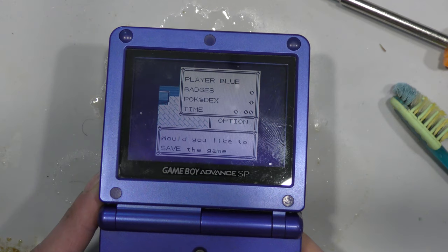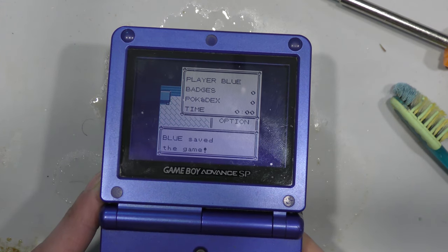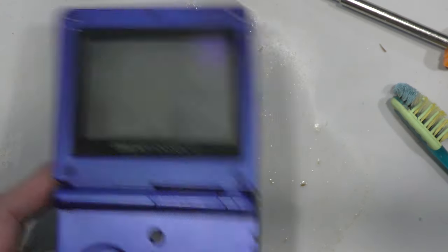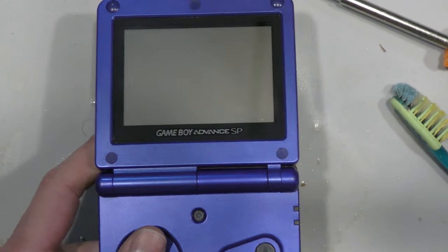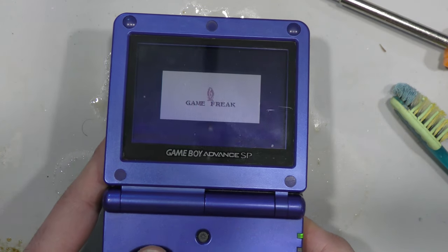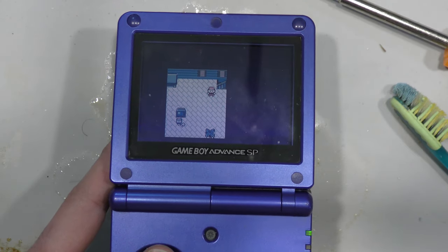have to do is reflow those chips, and anybody who's watching this video can do it. You can't cut corners, you have to have flux and a hot iron, and that's it. That's all it takes to reflow a chip. You lay some flux across the pins, and even if you don't drag across all of them, or you want to go slowly one at a time, listen, you can do this too. There's nothing special about this.